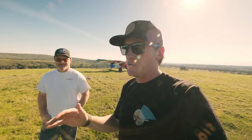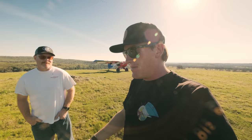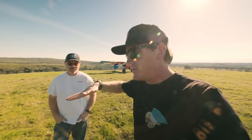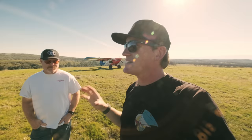And what blew me away when I put that on was that where my old plane would kind of just be dragging through the air, and I'd maybe have to add a little flaps to try to get it to where it wanted to plane out, or if it was a boat, it never got on step, right? Exactly, yeah. These wings, the bigger one, it just pops up and it goes. And I noticed that my cruise didn't drop. In fact, I got more cruise, and it just feels happier. So it seems like the little bit bigger wing on these newer, heavier Kitfoxes is the way to go.